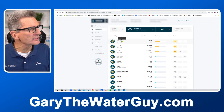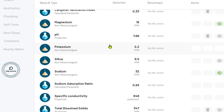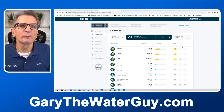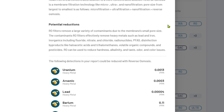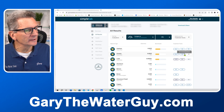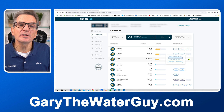Click 'all results' to see the different results. Alerts are highlighted in orange; ones in blue are not a concern. In our case there are concerns about uranium, arsenic, and lead. Scrolling down further you can see pH, sodium content which is quite high at 32 parts per million. On the right-hand side near the top, you can change the view from 'alerts' to 'treatment technologies,' which gives you an idea of treatment options — in this instance, reverse osmosis is the solution, addressing arsenic, lead, and other contaminants.